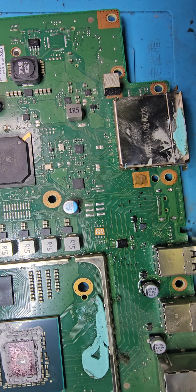Okay, the power button is over here. Okay, got an on off there. I've got an on off, so probably the chip or the port is creating a bridge, unless the power supply is not sitting properly. Let me try it once more. Yeah, I'm getting a one-time beep.